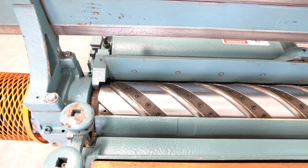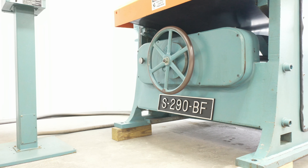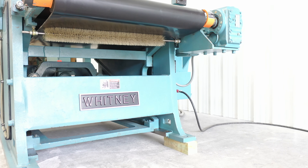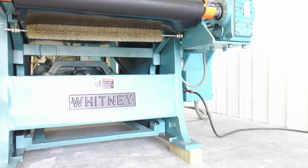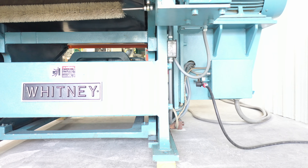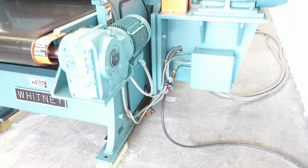The feed mat is brand new and hasn't even been dressed, while the drive roll has been re-coated. This was done as the original urethane roll coating was reverting, meaning the ozone in the air was causing it to become gummy, and thus making the back of the feed mat sticky. The proper solution was replacement with a factory mat and re-coating of the drive roll.